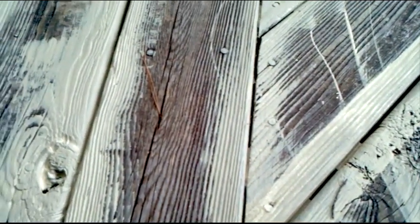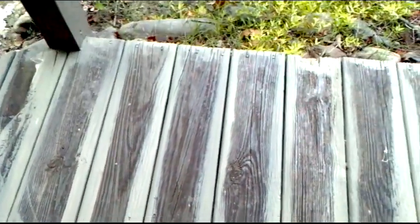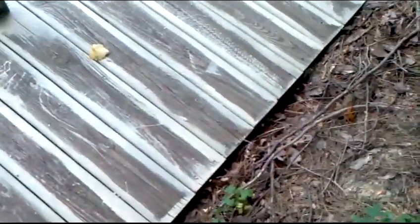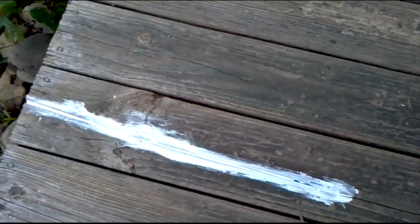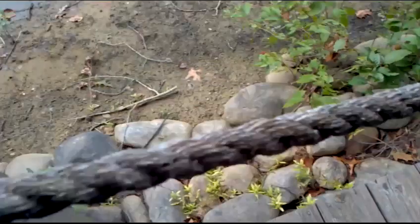Basically what we're doing here, we come in between now and put the stain that matches the color of the goop, and put that in between each board, nail down each nail again all the way through. We do this before we put the goop on every time. Also come through and fill the bigger ones with some latex caulk. I like the Alex fast dry because you can coat over it the same day — you're just basically trying to use it as a filler. Also do the same thing on top of posts.